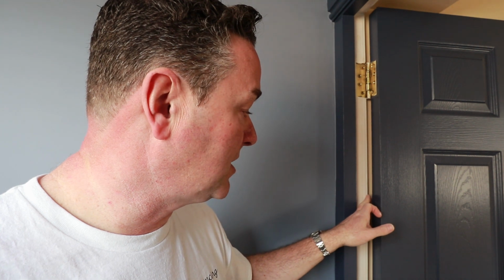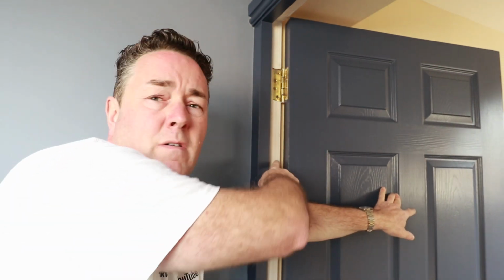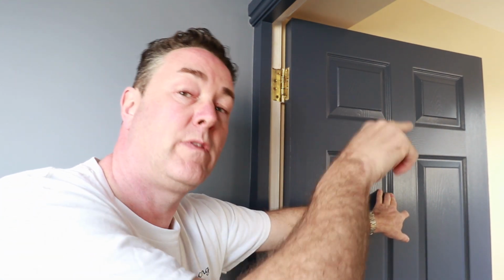And that's because I don't want to see the blue of that frame, because the blue is protruding, because that frame sits a bit more forward than the door. It's not a good fit. I'm going to see blue creeping if I do that blue. Similar colours won't matter, but with dark contrasting colours like this, just wait up what's going to look best. When this door's shut, move my door stop. Look, doesn't matter, we're not going to see anything. When we part open it, I'll accept that the door edge with the hinge is blue, but unfortunately, or the way this is going to be, that hinge edge there will be painted white with the room in there.